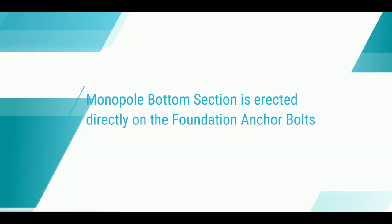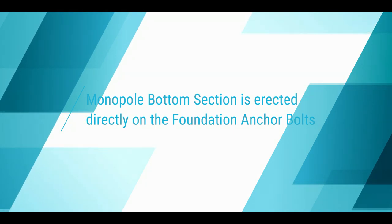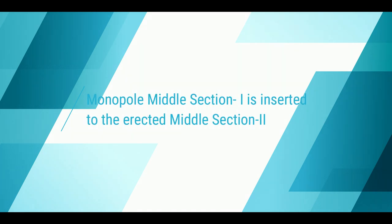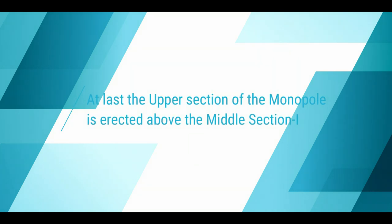The process of erection of the complete monopole is subdivided into 4 steps. The monopole bottom section is erected directly on the foundation anchor bolts. Monopole middle section 2 is inserted into the erected bottom section. Monopole middle section 1 is inserted into the erected middle section 2. At last, the upper section of the monopole is erected above middle section 1. We will see each step as we proceed.